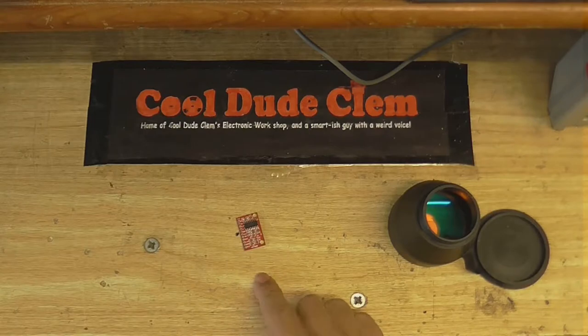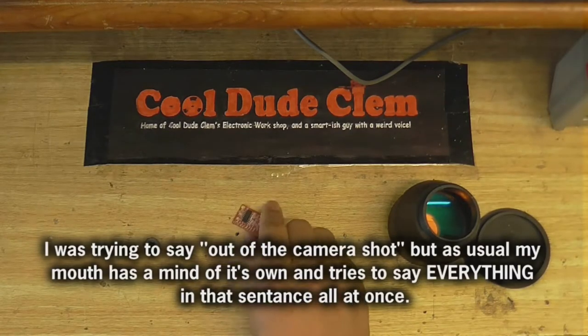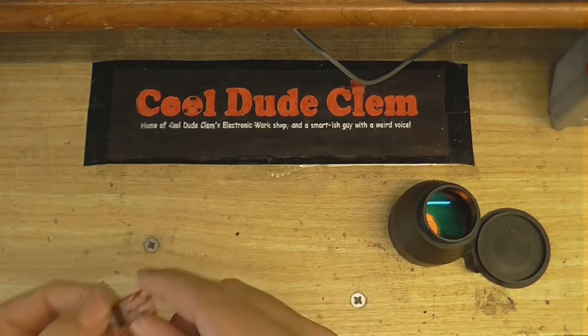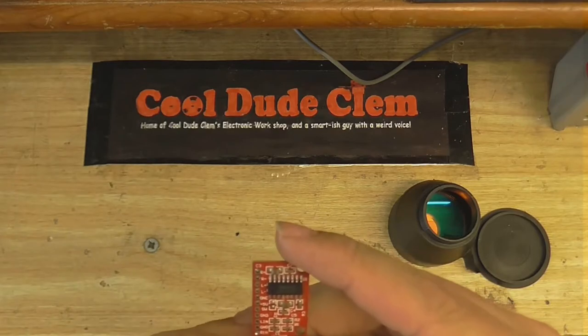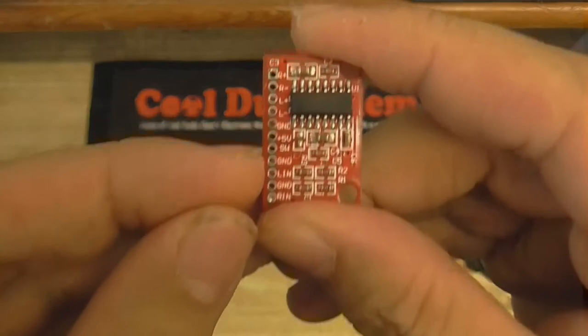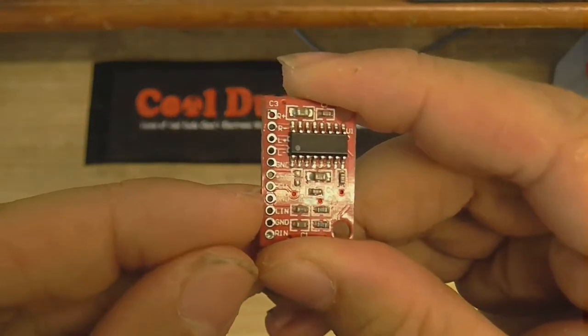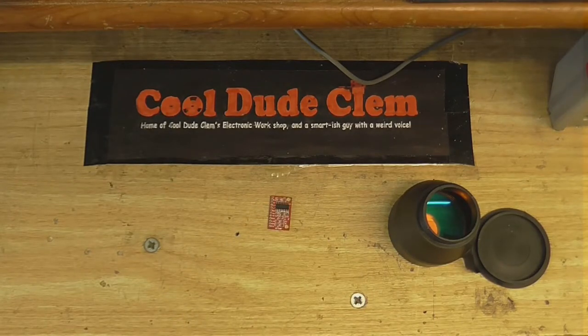So I'm going to wire this up and connect it to my two main speakers out here, which show up, and I'll see how it goes. I know John Audio Tech has one of these, but mine seems to have an extra pin marked SW — which obviously means switch. I think that's either connected to the muting pin or the shutdown pin; I don't know which.